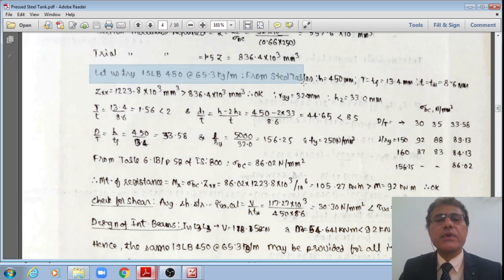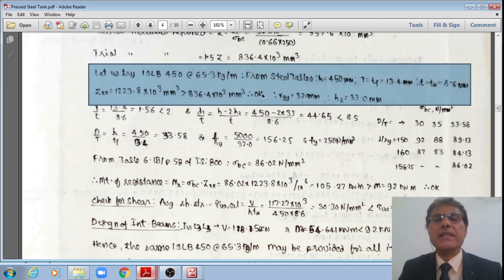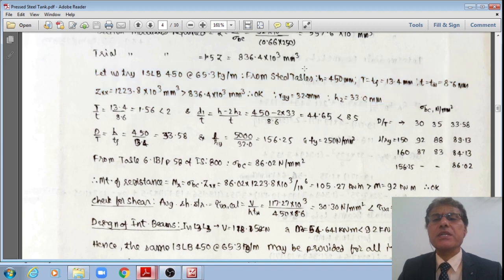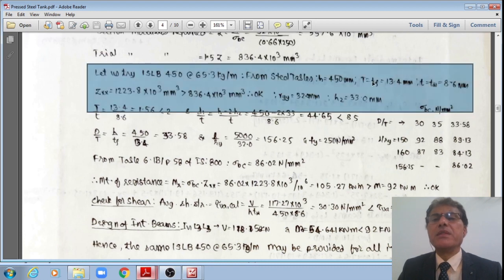Now, I'll try with ISLB 450, at the rate of 65.3 kg per meter or around 0.653 kilonewton per meter. The different structural properties from the structural handbook 1 are like this. Right? I have the depth of the section, h is 450 mm, the thickness of the flange denoted by TF or capital T is equal to 13.4, and the thickness of the web denoted by small t or TW is equal to 8.6 mm, and the section modulus provided ZXX is equal to